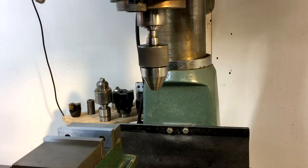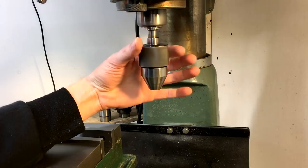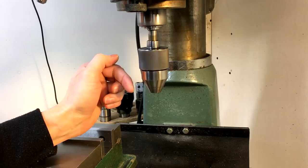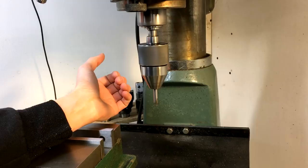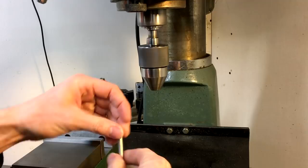I've just got a center drill for demonstrating. If I grab this, it'll stop spinning, then I push down and it continues to open further and further until it gets to its max capacity. This opens to three-eighths of an inch. Then you just hold your bit inside, put your fingers underneath and put a little upward pressure, and it grabs onto the bit. Grab this and push down and the bit falls right out. And that's all there is to it.